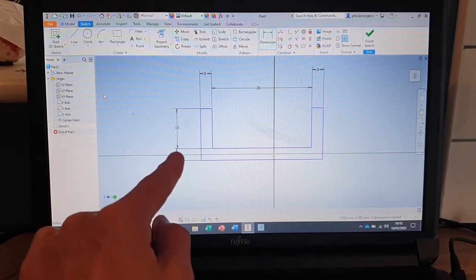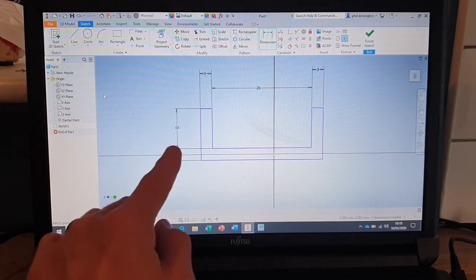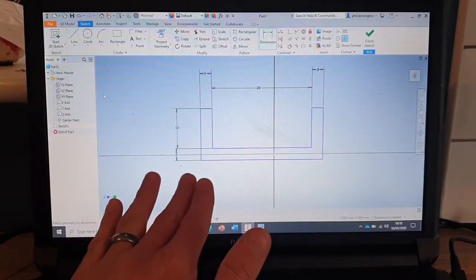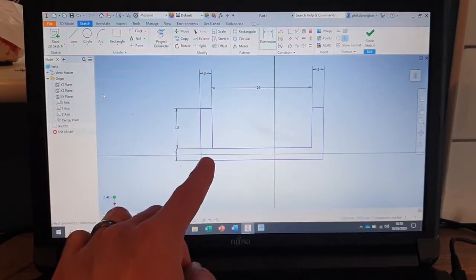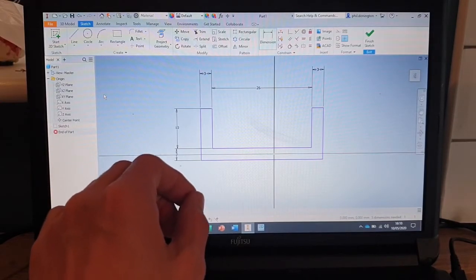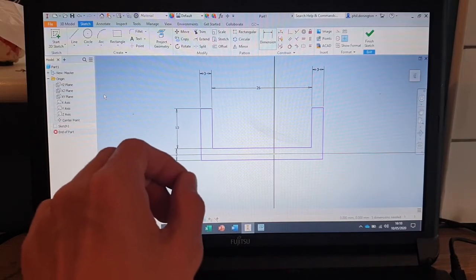I used a dial caliper, but if you had a very neat engineering ruler or something where you can take decent measurements, that's okay. The other thing to bear in mind when you measure things that you're going to 3D print is often a 3D printer will grow the object, because the plastic that comes out of the nozzle isn't exactly the size that you print it.